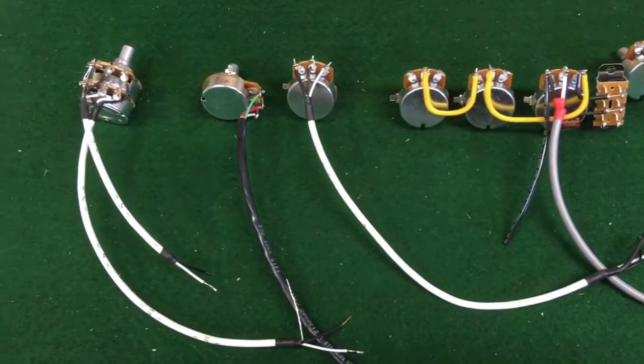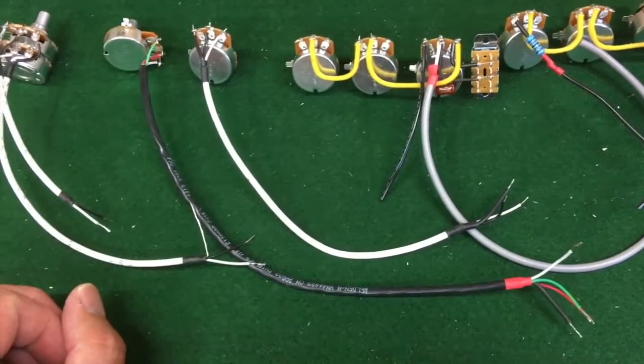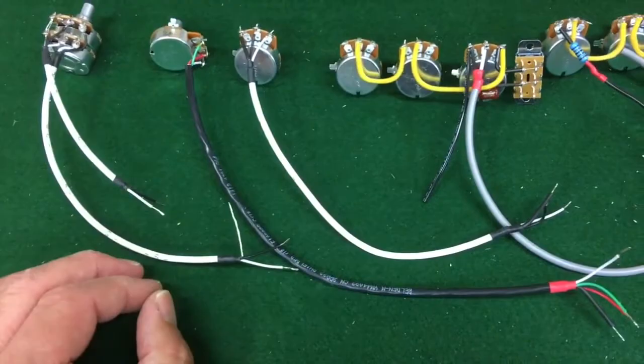Some of these circuits are very high sensitivity — for example, the dwell control. You could say that shielded cable adds excessive capacitance to those signals, and in theory that's true, but the cable runs are so short that it hardly makes a difference. In fact, with my capacitance meter I can actually not read the capacitance of these cables.